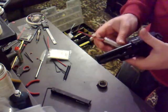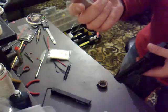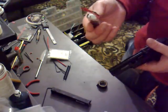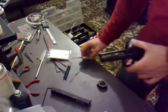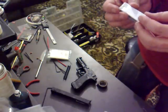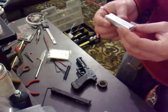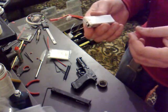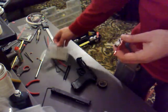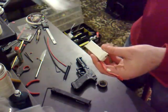A bit weak, and there are these 7.4 volt LiPos available from Amazon.com. I would recommend other places but that's the only place I've found them so far for these specific ones. They're 25C discharge rating, 900 milliamp, 7.4 volt LiPos. You can buy them in singles or in pairs — pairs are useful if you're worried about destroying the first one so you've got a backup.